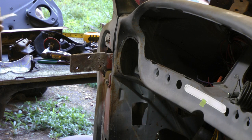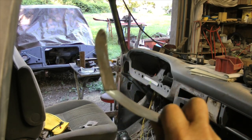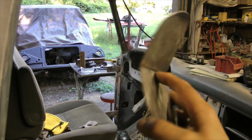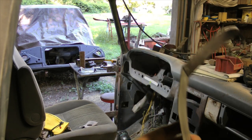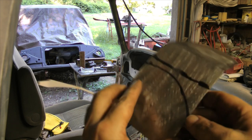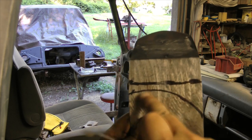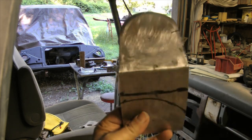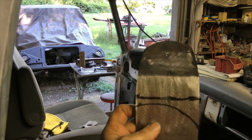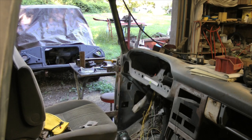Putting it in my way. All right, I'm going to break this on the brake. All right, I bent the panel, put a little bit of extra roll in it right here. I did it over on this side. Well, you can't see, but just lay it up there and roll it up under. I made a pattern off the other side when I formed the belly, the bowl, whatever you want to call it, so I just loosely use that same pattern. So here we are before we go in the planishing hammer, hoping to the metal shrinking gods that I don't screw this up. So let me get the camera set up and we're going to do that.